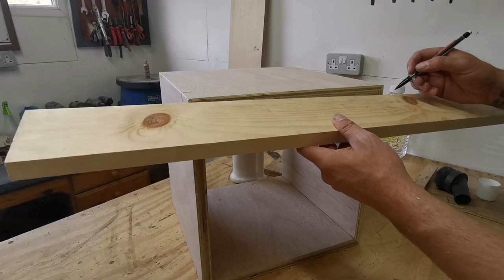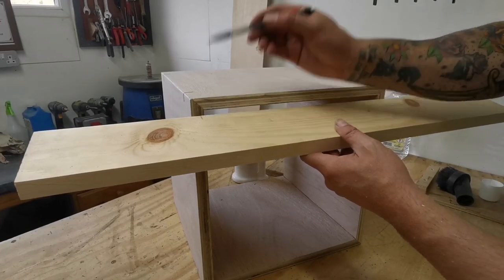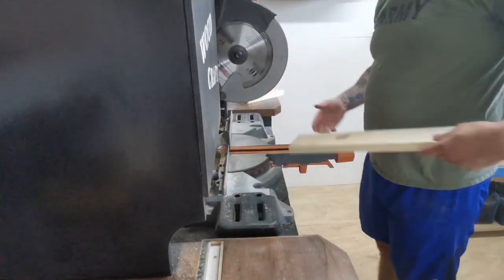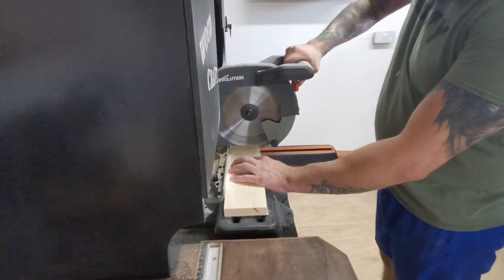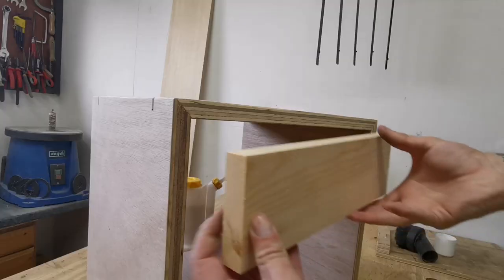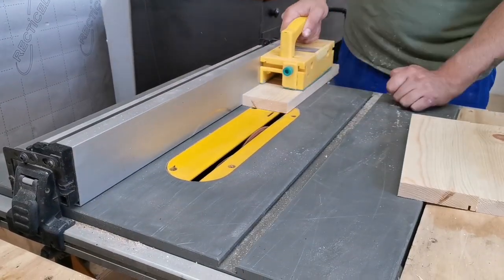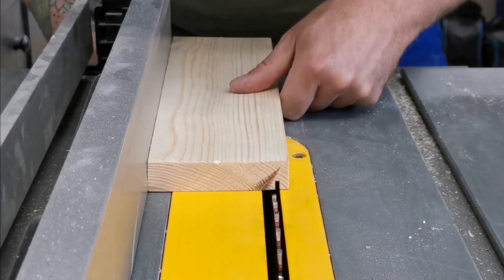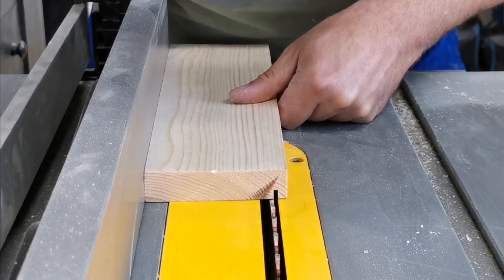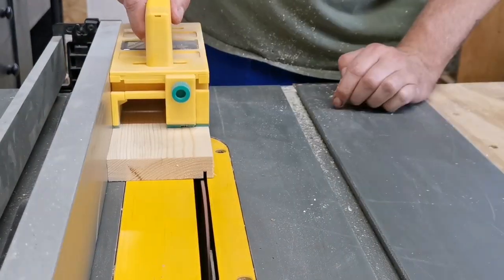For the drawer front I'm going to be using this piece of pine, but I don't want these knots in here. So I'm going to cut those knots off and then come back, get a referential measurement, and get that perfect. I then go back over to the table saw and put a six-millimetre groove in all the pieces of the drawer so I can slide in the bottom panel. I do this in two passes because the kerf of the blade is about three millimetres or just under.